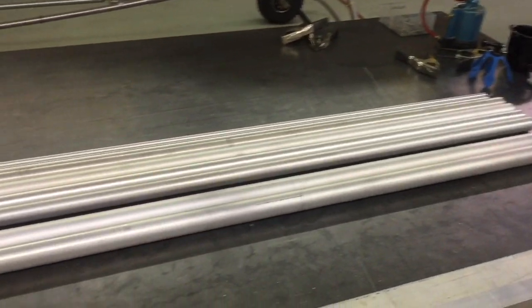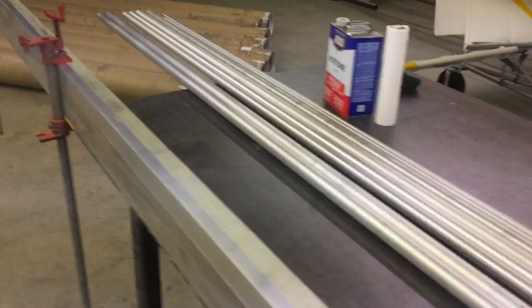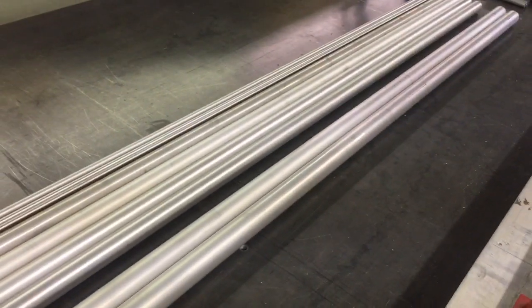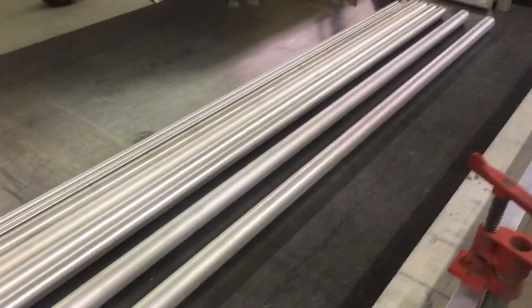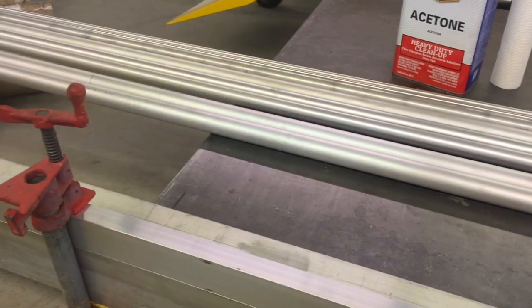What I've got so far is a pile of aluminum. Our wing is all welded aluminum construction, and these will be all the material I need to build the main spar. It will be 24 feet long when it's done. The middle section is a 12-foot tube, and then it'll have six feet added on to each end to make 24 feet.